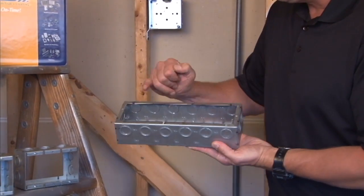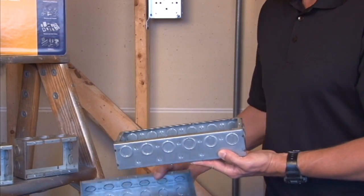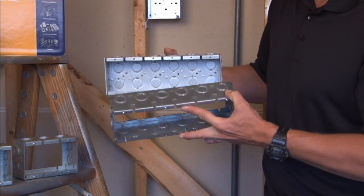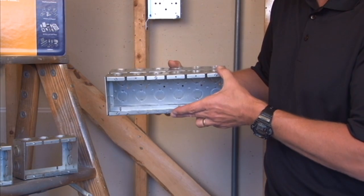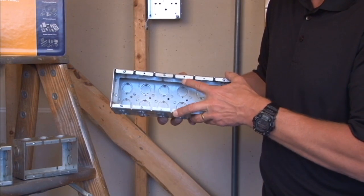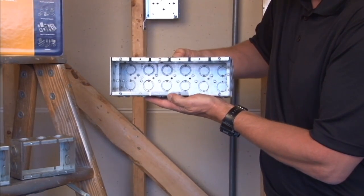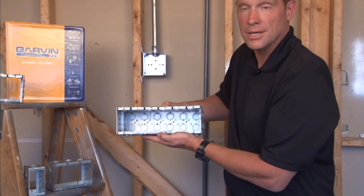The back of the ring has slots that are perfectly aligned to match up with the standard masonry box that is in the wall. You simply line up the extension ring directly over the mating size box, remove the screws in the front of the device holes and screw them into the slot in the bottom of the box to attach the extension ring directly over the box.